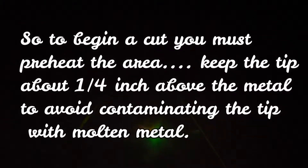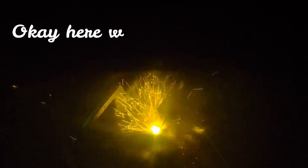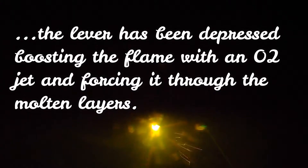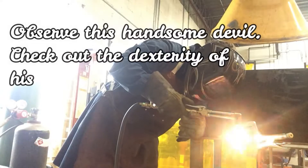I use a neutral flame to cut this. I am heating up the tip there, making sure that it gets yellow and sweaty, and I can tell it's about to have fusion. So I'm going to be real patient, and then I hit the O2. I'm going to give it a little jet blast to cut through the metal — it's more like melting through the metal.